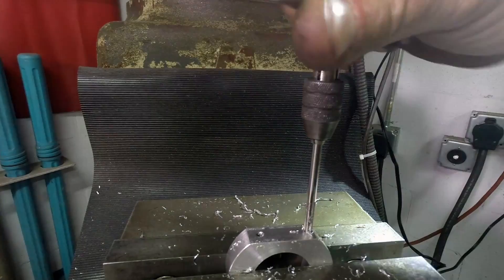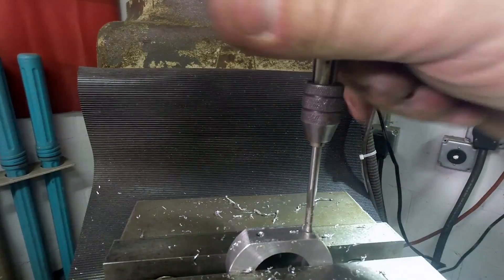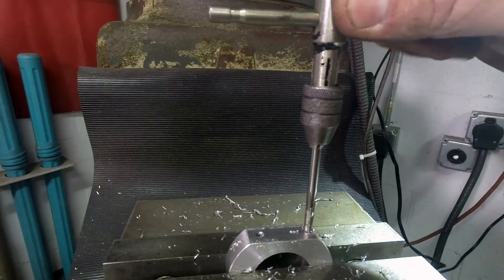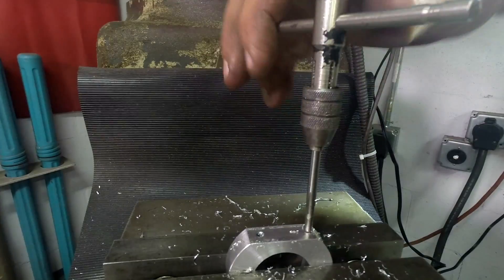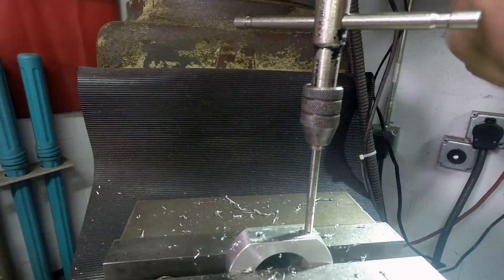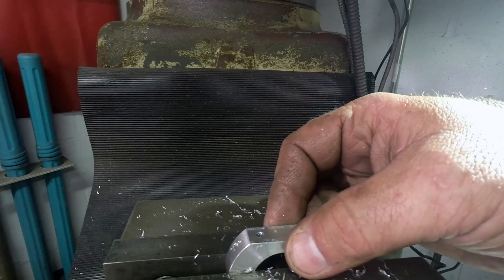When we go back to zero, we're right over the top of the first hole we drilled — zero, zero, zero — that puts us right in line. What is most critical on this part is the spacing between these holes. Left-or-right spacing — not so much. You'll notice it's off just a little bit, and that's because some of these wound up being a slightly smaller diameter than the others. I had some saw marks I wanted to get out from when I roughed them out. The outside dimension is not critical, but I do want to be able to polish them and make them look nice in the end. This is tapped out through an 8-32 — the part's out of here.